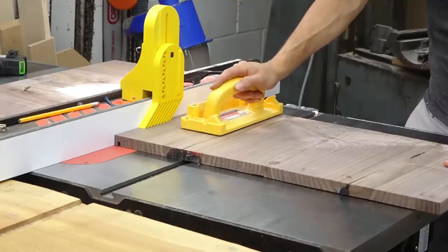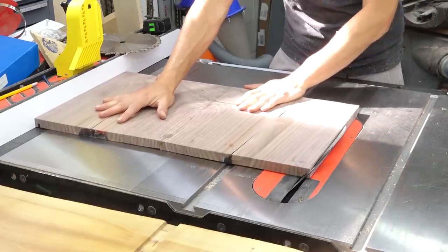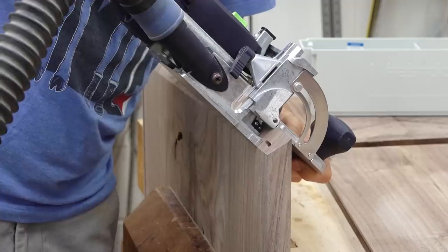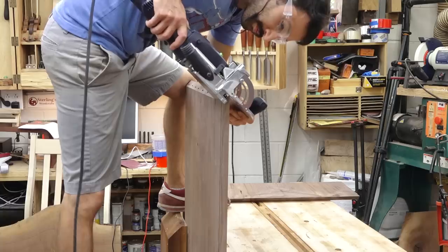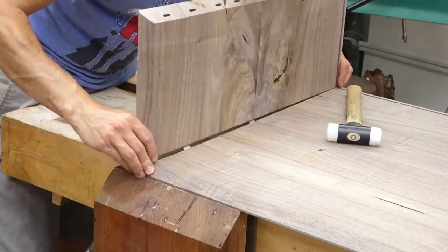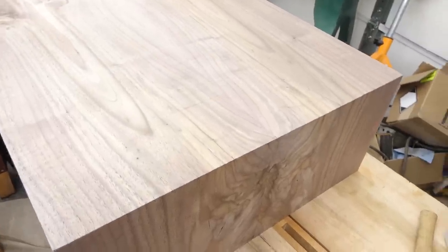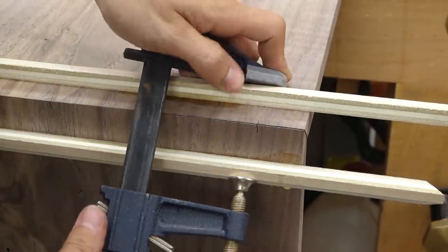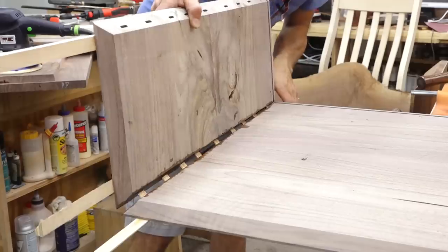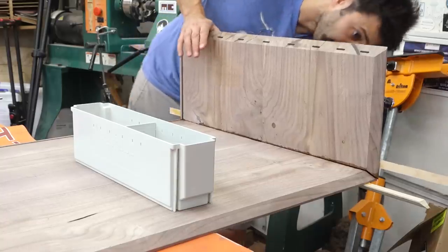Once I'm happy with the cuts, I'll head over to the table saw and cut the grooves for the back panels. I'll add the beveled chamfer detail to the front edge and also make the mating bevel cut on the bottom of each side. All the miter joints in this project will be reinforced with floating tenons — a la Domino. In preparation for the glue-up and to aid in a final check, I'll glue on the plywood clamping cauls. These cauls will allow for clamping pressure to be applied across the joint, helping everything close up nicely. With everything coming together really well, I can move forward with getting these parts glued up. I use epoxy so I would have as much working time as I could possibly need.